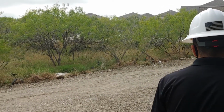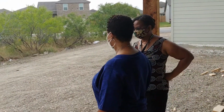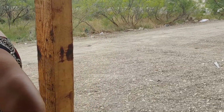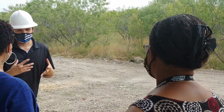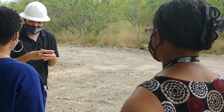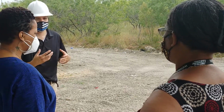No, that's pretty good. You'll have a 6-foot privacy fence here. We won't lay grass right on top of this. We're gonna add 4 inches of topsoil. It's orange almost. We use that. That's called a sandy loam. It's better than the black topsoil. That black topsoil clumps together and gets rocky. The other stuff doesn't, and it also holds moisture better.